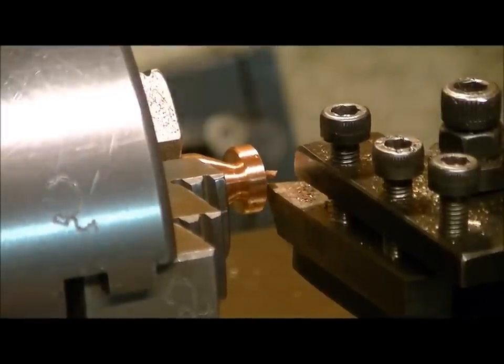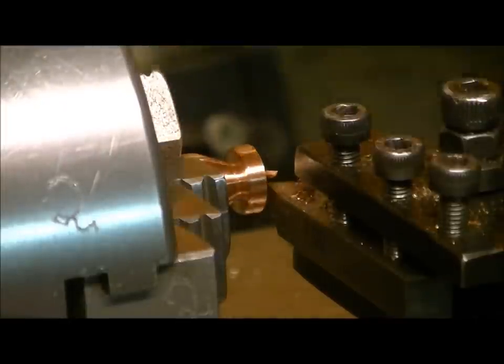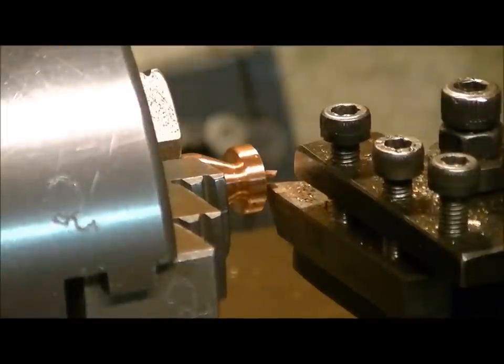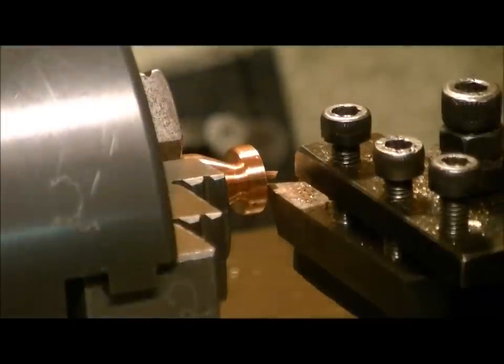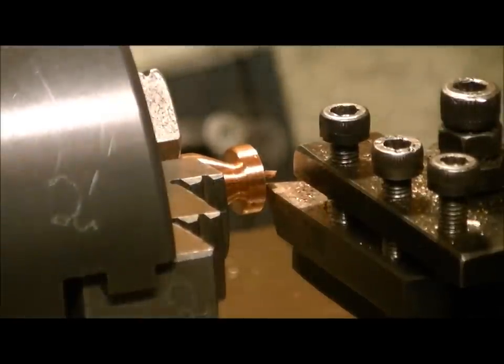When I'm ready to start drilling, I'm going to make a few of these because I've got a couple inches of copper left. When I'm ready to drill them all, I'll actually do that stage and you'll see how we have them set up for drilling. We're going to do this at 970 RPM for the facing, and I do this because it does make a much smoother cut.